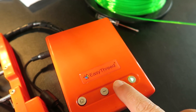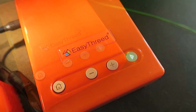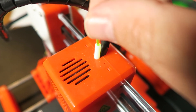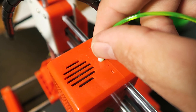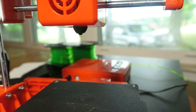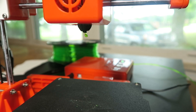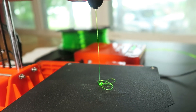The next is loading the filament. When you press this button, you'll see the plus sign flashing. When it flashes more steadily, it's ready to load the filament. The filament will grab since it is a direct drive extruder. As you can see, the filament starts coming out. I had it set around 210 degrees.